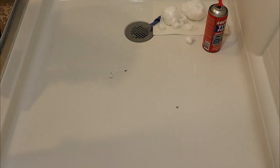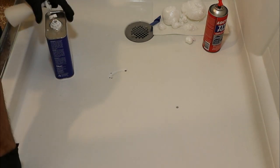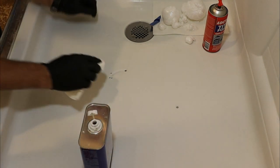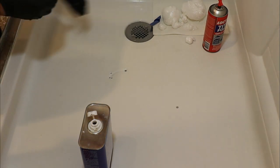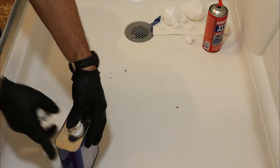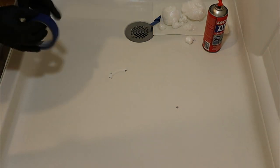Do a little bit more cleaning with acetone, just in this bigger section here, because I really want the stuff to stick and to adhere. Okay, just where we ground in this groove here, and this one. Okay, I don't really care if we melt the surface around a little bit. It's still acrylic, it's still gonna be waterproof. Okay, now I'm gonna take my vacuum cleaner one last time. I'm gonna take some masking tape.